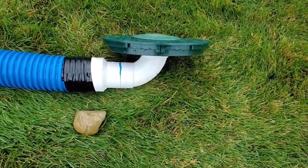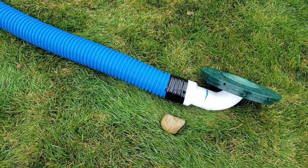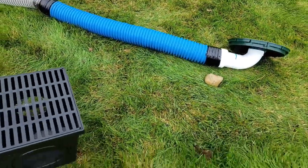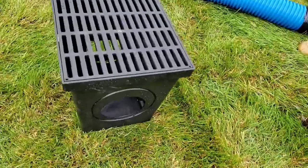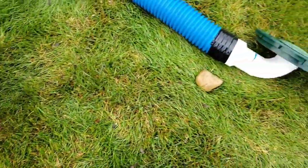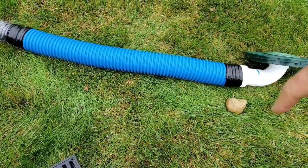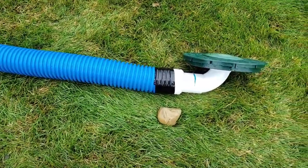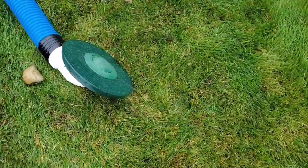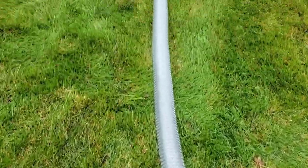Come wintertime, a basin just becomes a block of ice. This setup is bulletproof — this is how you keep your line from freezing up in the winter. Now, this is not going to keep your downspout from freezing up — the only thing that'll handle that is heat tape in the downspouts. When you bury a big drain basin in clay, you've got five gallons of water asking to perk in a small area — it's not going to happen. With four-inch pipe and knife cut, we're just asking it to leach a small amount of water, and there's only about a cup of water left in the elbow. This will keep your underground line from freezing up.